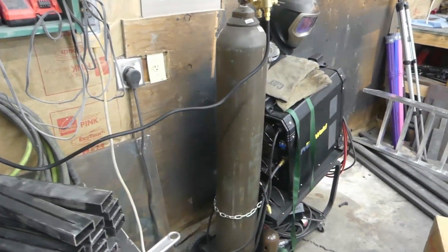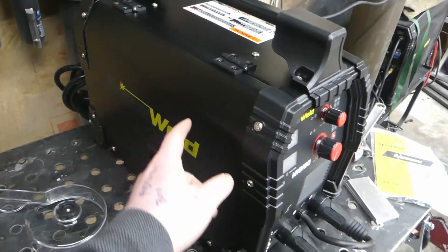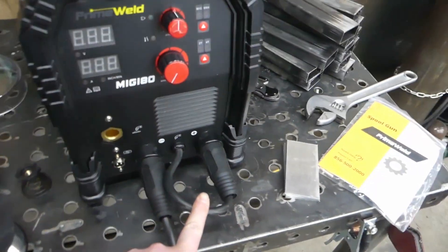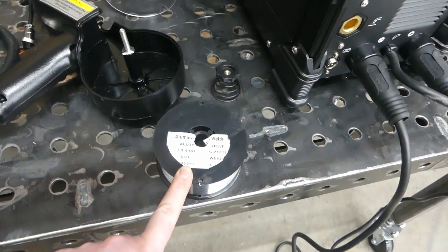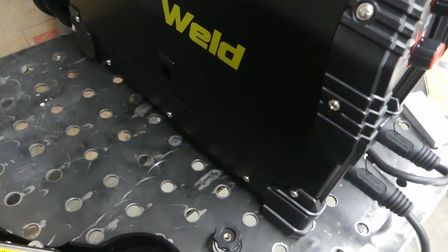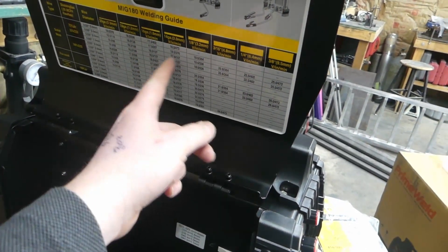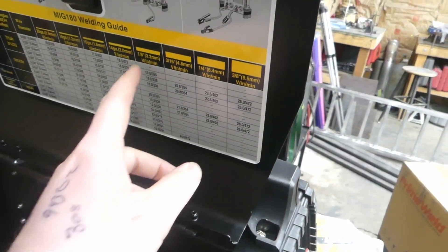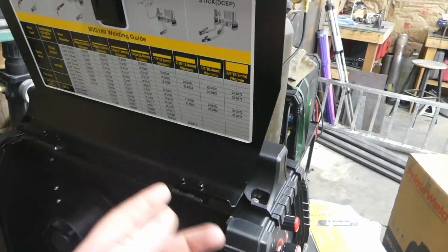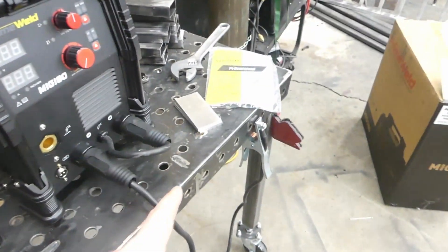I've got it sitting on a bench here, ran my argon bottle through my Victor regulator. Inside the panel where the wire goes, there's a chart on how to set up everything. It says electrode positive, ground on negative when going through the spool gun - and I was right, it is 4043 wire, 0.9 millimeter which I think is 0.035 inch. The chart they give you is nice, and from what I was reading online, their suggested numbers for speeds and amps are actually pretty close - you just fine-tune it for how you like to run.